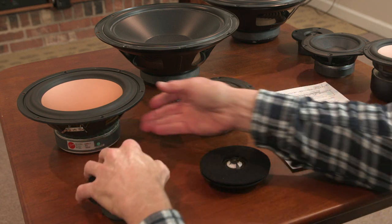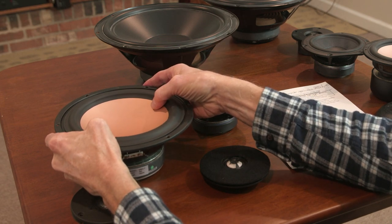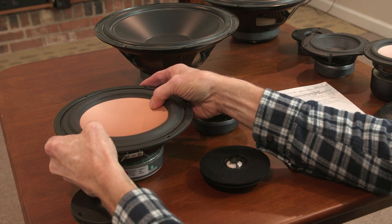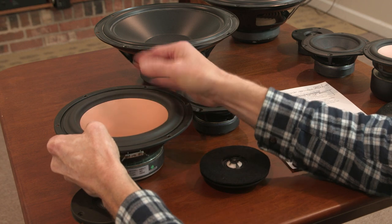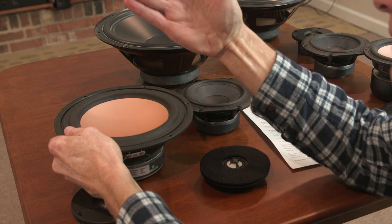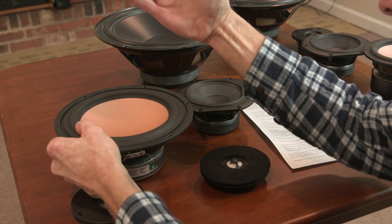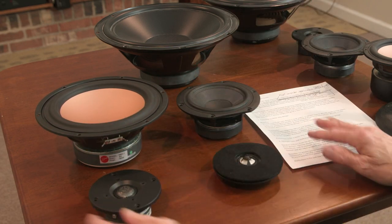Well, that same kind of distortion happens in a bass driver when you have a driver like this in a two-way design. Let's say it's producing a 1,000 cycle frequency, and moving like that. And then it simultaneously produces a 30 or 40 cycle wave, say. Now you've got the 1,000 cycle waves modulated and carried on the 40 cycle waves. And so the 1,000 cycle waves will be coming at you, arriving a little compressed and then a little bit elongated as it's carried away, and then compressed and elongated. Hopefully that makes sense. It's called Doppler distortion. It's a common thing. You can read about Doppler distortion in speaker systems.